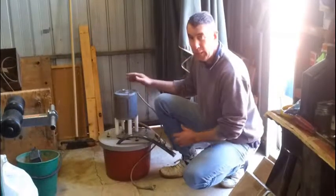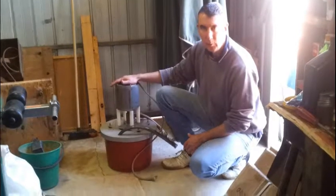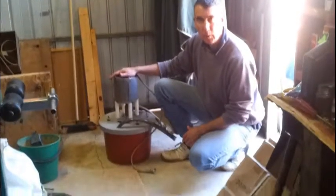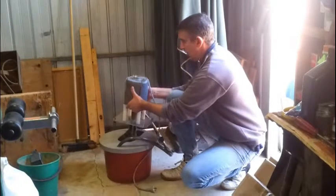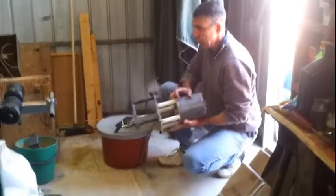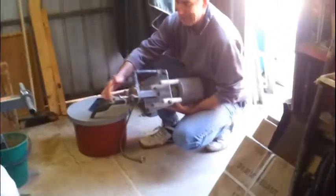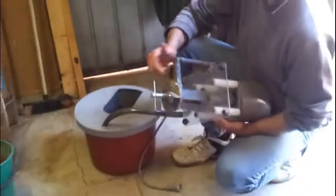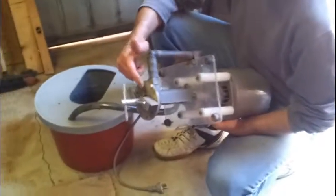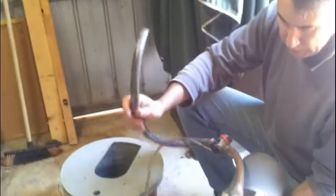Now I want to talk about our pumping unit. This will be pumping the silicon carbide grit with water up over your mother of pearl on the multi-slicing machine. This unit is actually a dual purpose pump — it's been custom made to actually agitate or stir the grit and the water. The grit and the water come up through the impeller and are pumped up through the hosing up to the top of the machine.